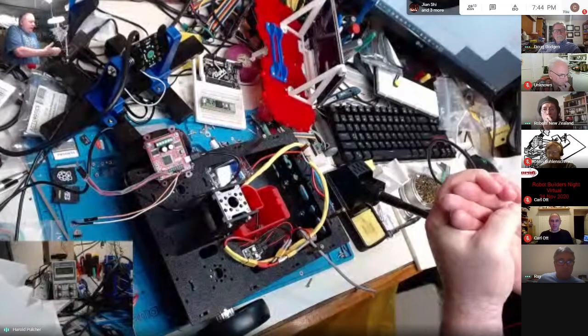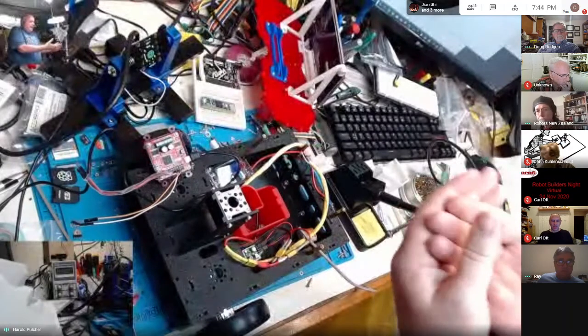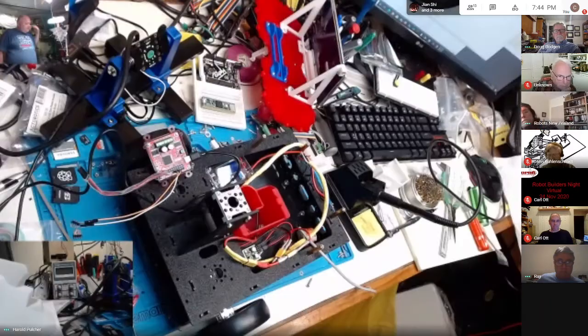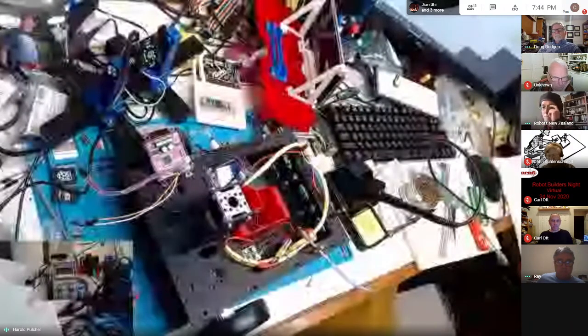Because one of the things I learned pretty early on when I'm making my cables, the little DuPont ones like those, is I crimp, but I also solder them, because I found that level of reliability was really needed. Every once in a while you'd find one that wasn't working, and it was because the crimp actually came out or whatever. When you crimp down on them like that, it could be that you got crimped good on the insulation, but the actual wiring connectivity kind of just wallows around in there. So what I'm doing is I'm pre-tinning, then putting it into the little metal thing, crimping it, and then I solder it, just heat it up, and the solder that's on the wire already usually works pretty good. And you can't pull them out anymore then. Yeah, I think that's a grand idea. And so I'm going to roll with that when I build these things.